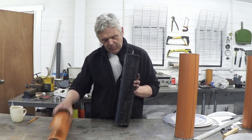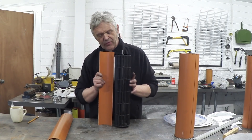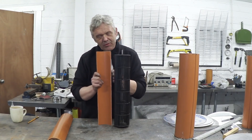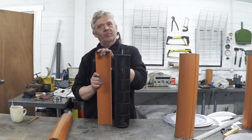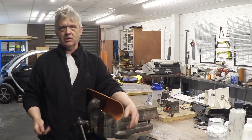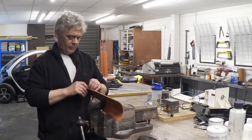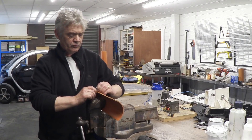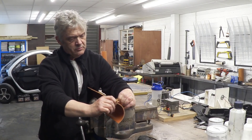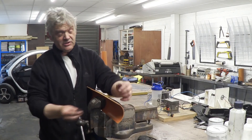Then what we're going to do is arrange those around the disc. If you look at the rotor, you'll see that it's scooped one way — when we put these fins in, we want to scoop them the other way, so the wind gets caught and blows into those scoops. When we cut the pipe it invariably has a rough edge, but it's PVC so all I do is take a carpet knife blade, stick it in the vise, and run the blade down — it acts like a cabinet scraper and cleans it up really easily and nicely.